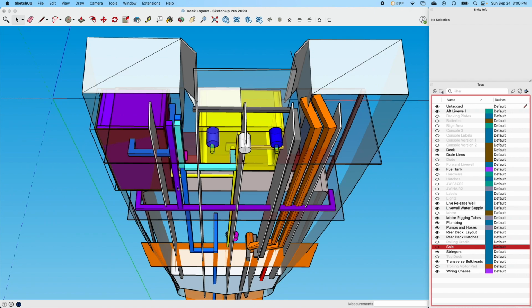And then we'll have one of these that comes over here. I think it's maybe this purple one, which will be the main cockpit floor drains. They will be the only other thing through that 1.5-inch line. They'll have a dedicated 1.5-inch line that they'll drain out of. So that should be more than enough. If for some reason that cockpit gets flooded, a solid 1.5-inch line is about all I could think I would need.